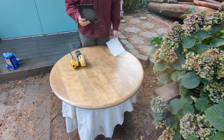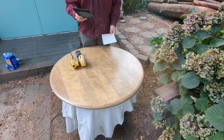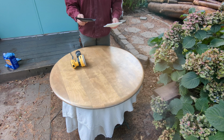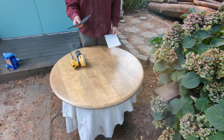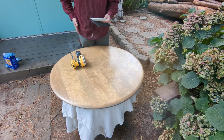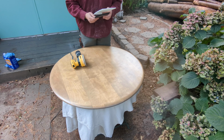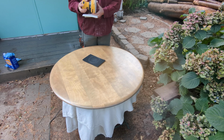So what you're going to use is a white Scotch-Brite and a black Scotch-Brite. The black Scotch-Brite is your very fine quad steel wool type grit abrasion. It's super fine. And this is your non-abrasive pad. So we're gonna start with this to take out some of the bumps and unevenness in the coat. And then we're going to use this to buff it and kind of make everything nice and smooth. I'm gonna start with it on my DeWalt and very little pressure.